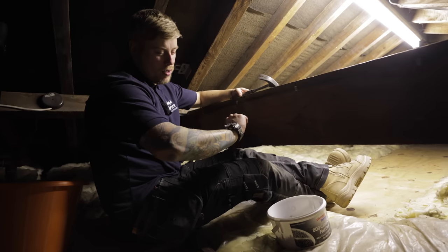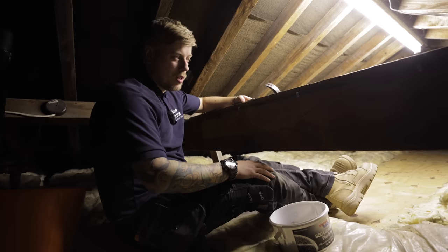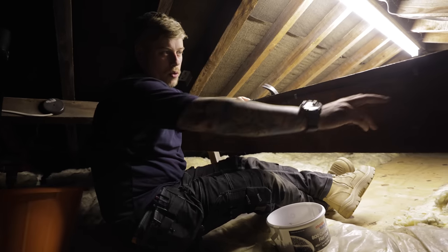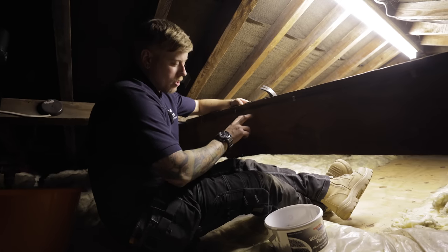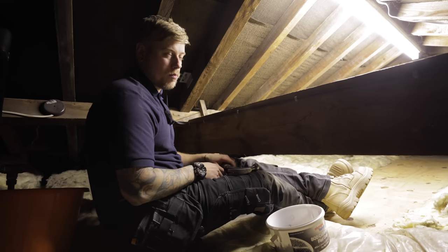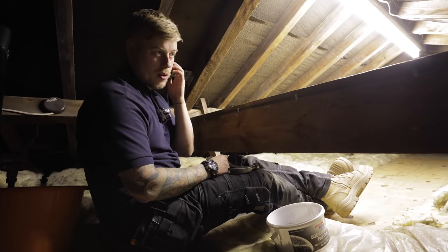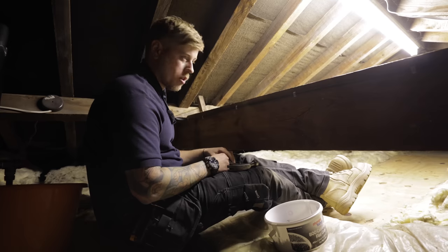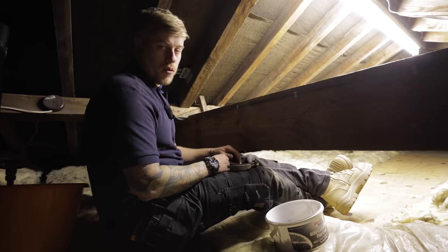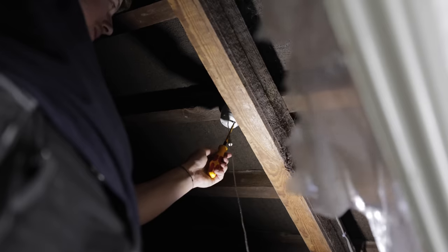Wayne's just having his 10-hour lunch. I'm clipping the DC cable through the loft. When we've got the inverter we'll put some DC stickers on here so people know it's live - obviously when the isolators are off, these cables will still be live when there's sun outside. We'll label it all up and it'll be ready on the roof tomorrow when the roofers turn up and we do the rails.